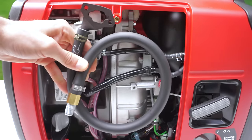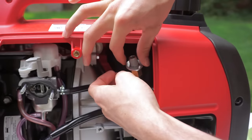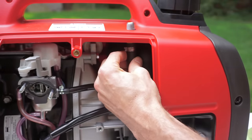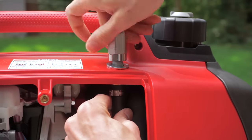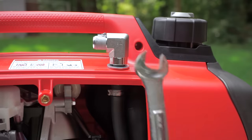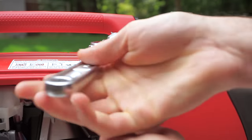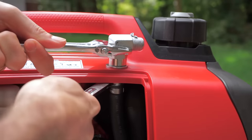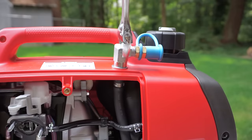Now we're ready to install our propane fuel line. We need to route the fitting behind these gas lines, then place one of the metal washers that were provided on that fitting, and route the fitting up through the hole we just drilled. Place the second metal washer on top of that fitting, then place the elbow onto the fitting and thread it on by hand while using a wrench to hold the fitting down below. Tighten the elbow with a crescent wrench, then using two crescent wrenches, install the male quick connect on the front of that elbow.